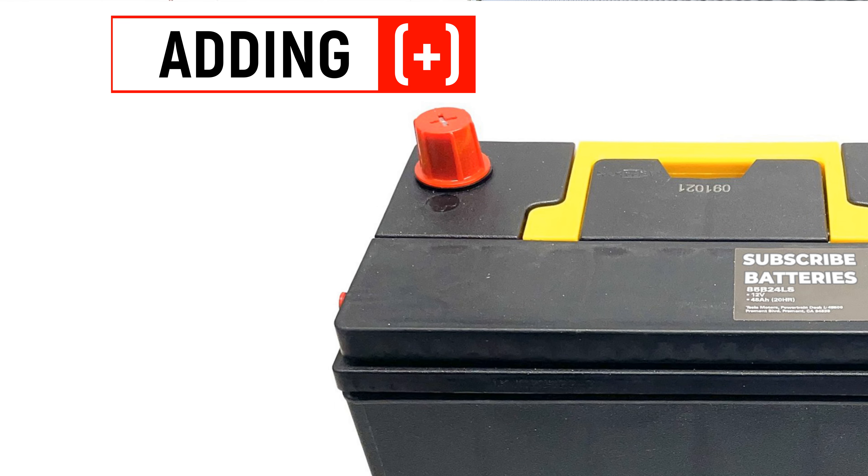After the trickle charger indicates that your battery is full, that's a good time to check the water levels. If you do need to top off the water, make sure you're using distilled water, and remember you always want to charge a battery before you water it to prevent boil over. Now if you have lithium batteries, I would advise checking your owner's manual or the battery manufacturer's website for winter care instructions. All lithium batteries are not the same, so there may be different storage recommendations based on the battery manufacturer.